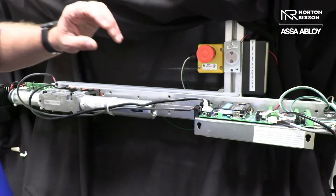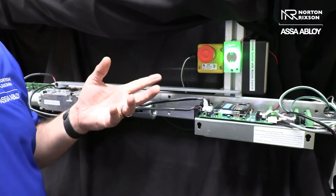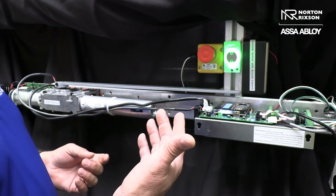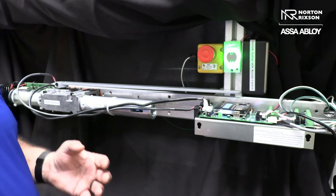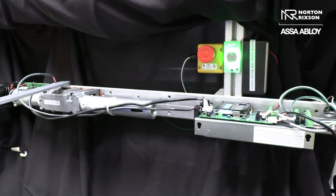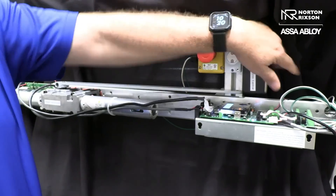Now we're going to send the signal for the access control. As you see, the 24-volt light is now on. Before, what would happen is your relay would fire but your door would open — it was all locked into one. Now we have the ability to separate that. Your 24 volts is on, your lock is unlocked, and now you have the option to use the outside push button. Now when we lose the signal from access control, everything goes back off and your outside push button no longer works.